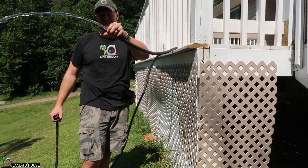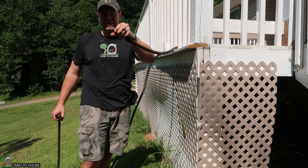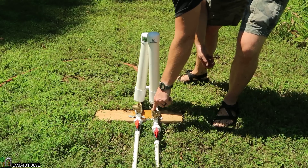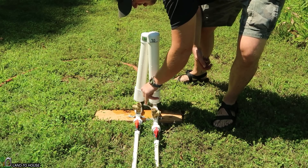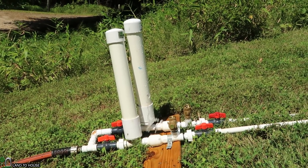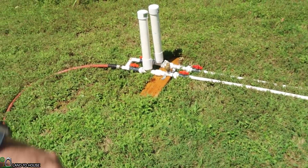There's one issue you have when trying to fill from the top — all the air pressure below just spits the water back out. I wound up having to press the valves manually down here to fill the delivery pipe, because all the water I put in up top had air behind it and just squirted out. So it was easier just to push the valve down here and fill the pipe from the bottom.